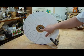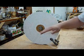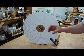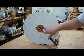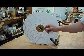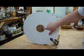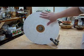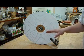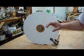What I did first was take my rotary tool with a sanding drum and kind of scuffed up the inside surface. I didn't ream it out — I just scored some lines in it. The reason being, I didn't want to elongate the hole; I wanted to make sure it was still true when I put the MDF in. So that was epoxied in place. I drilled a hole through that for the lamp rod to go into and threaded that in, epoxied that into place. The hole setup is set into a recess in the MDF — it's important to do all this work on the lathe. I just cannot stress enough, you definitely need to do it on the lathe. That way everything stays centered.